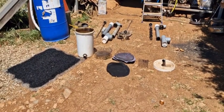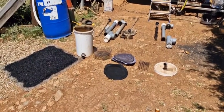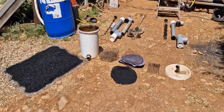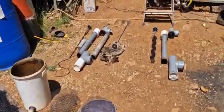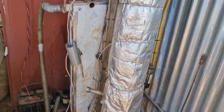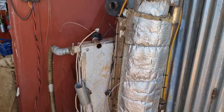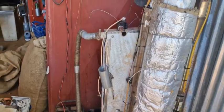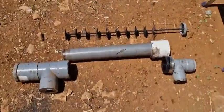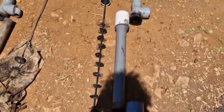Hello, welcome back, thanks for tuning in. Some subscribers asked me about my filter system, so that's what we're going to look at today. We all know that gas from gasifiers is hot, so it needs to be cooled. There are different methods for that, like fuel preheating and air preheating, and then rejecting as much heat as possible. The more cold it is, the better. But then we need to get rid of the moisture.